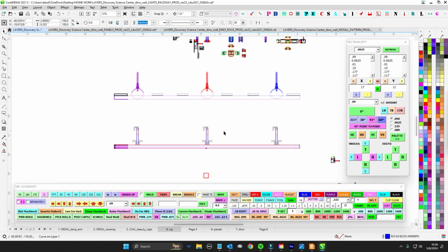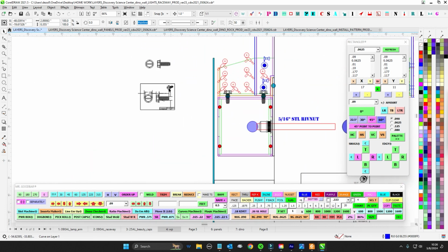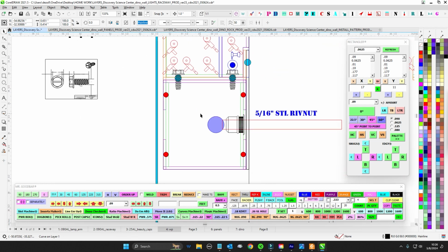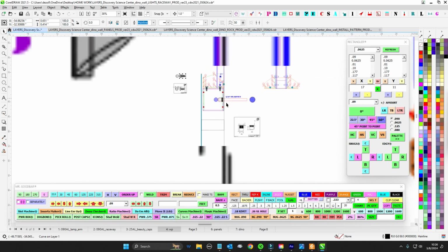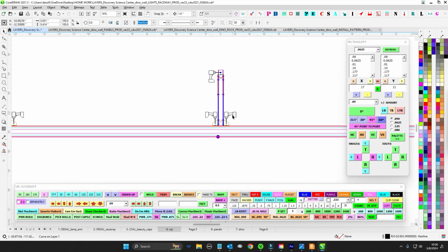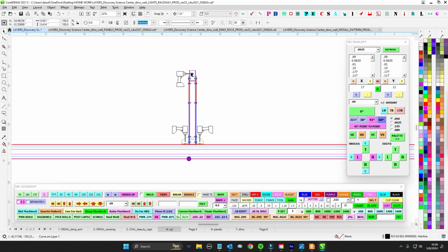And then this gets frapped. Let's make sure we use the blunt nose screws, because pointy screws with wires don't mix. Could scrape open a wire. Be careful. But you're just going to frap these into the top of the raceway like that. So that's how they install, and then one goes to the wall.